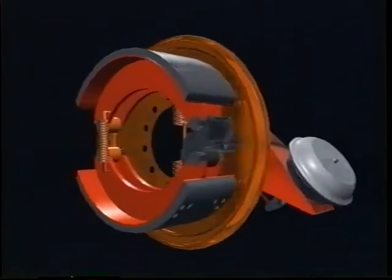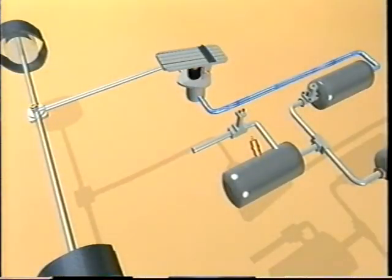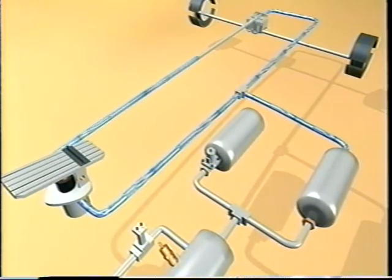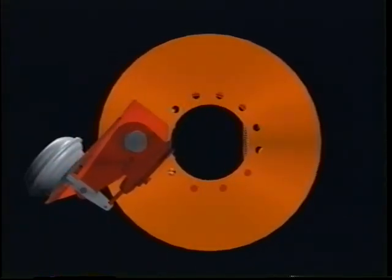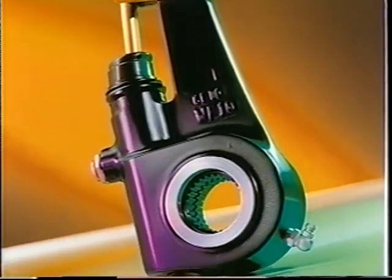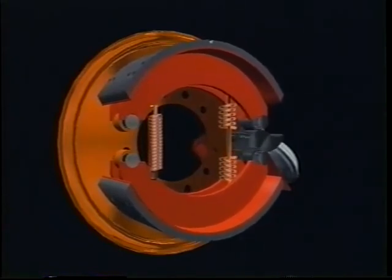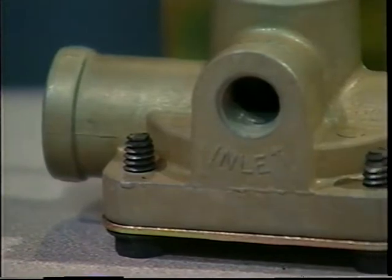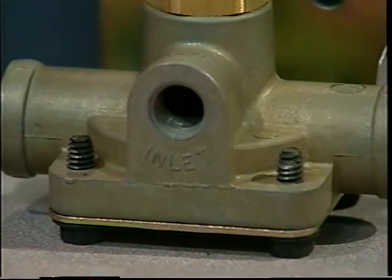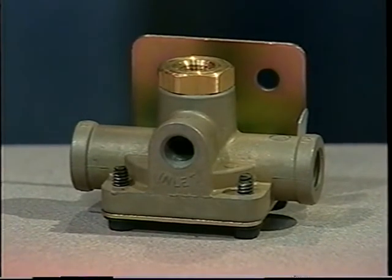Now let's see what happens when all components work together in a cam brake application. When the brake pedal is pressed, air pressure flows through the lines and valves to the brake chambers at the wheel end. Brake chambers contain a diaphragm and a pushrod encased in a housing. The air pressure exerts force on the diaphragm and extends the pushrod, which moves the slack adjuster, converting the chamber's linear motion to rotary motion. The automatic slack adjuster also maintains proper brake adjustment. The S-cam forces the brake shoes apart and against the brake drum — the friction caused by forcing the shoes against the drum is what actually stops your rig. A quick-release valve with a two-way check valve provides anti-compounding protection, eliminating the possibility of using the service brakes at the same time the parking brake is actuated, which could damage brake components due to excessive force.